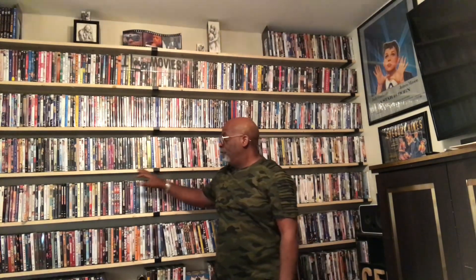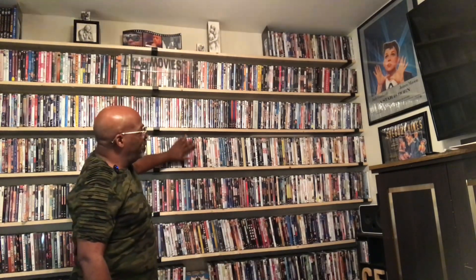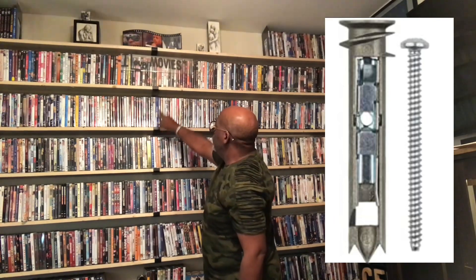The wood is just something you get from your local hardware store or Home Depot. I also had to purchase something because this is drywall with plaster underneath — there are not studs everywhere, so it cannot hold on its own. I found on Amazon these heavy locking anchors that hold up to 99 pounds per anchor. There are three anchors in each bracket, so it's got lots of support.